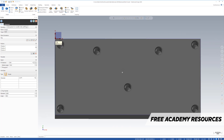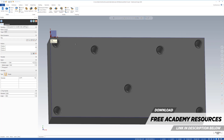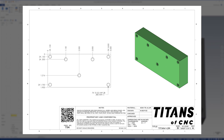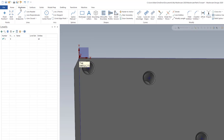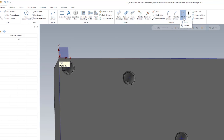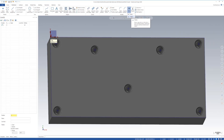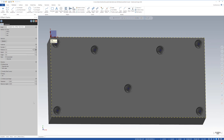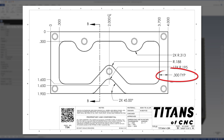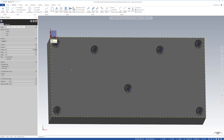Now I'm going to grab the model, tilt it, and you can see the holes perfectly in place. I'm going to hit the check — done. Now let's go to sheet 3 of 3 and actually put the pockets in. The first thing I'm going to do is go back to wireframe, then go to offset, drop down, and hit chain — because I want to do the entire rectangle. I'll click the rectangle one time and it chains the entire thing, which is exactly what I want. I'll hit OK. I want to offset to the inside, and if I look at my print I can see 0.300 typical, meaning it's typical all the way around.